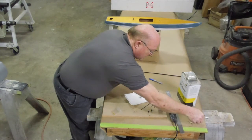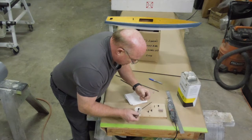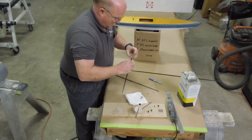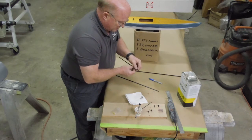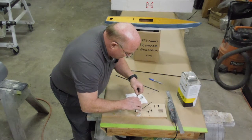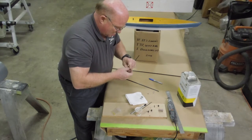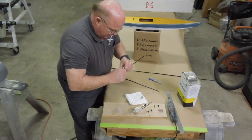I've got my previously mixed epoxy, and the fit is so tight you actually don't really even need to thicken it. It will be just fine with just a little tiny gob on the end. I'm going to go ahead and put just a little gob of goo on the threads, and I'm going to thread this into here right now. It's not going to do one bit of harm, and it will also give me the ability to pull the tube out should I want to.